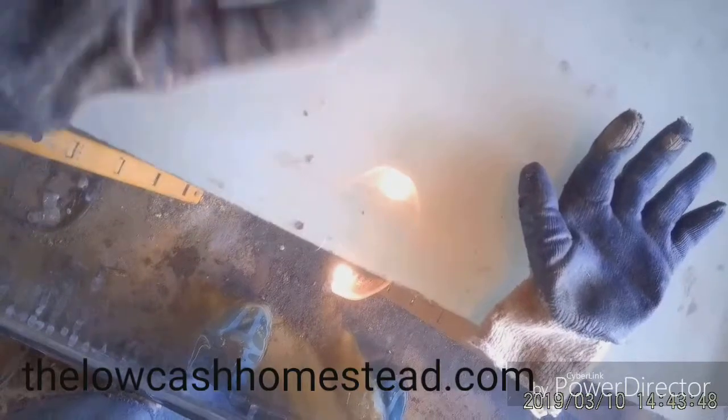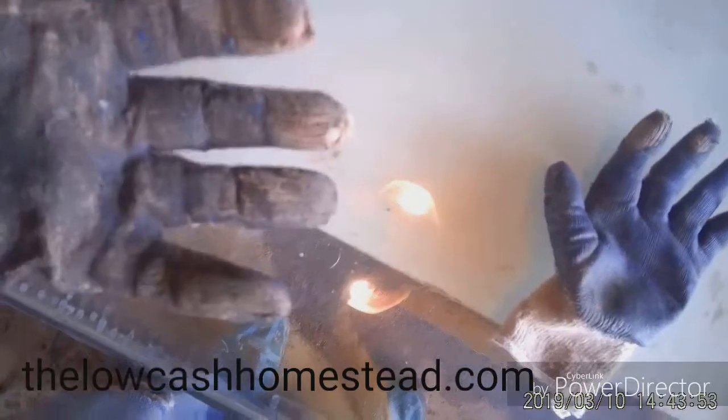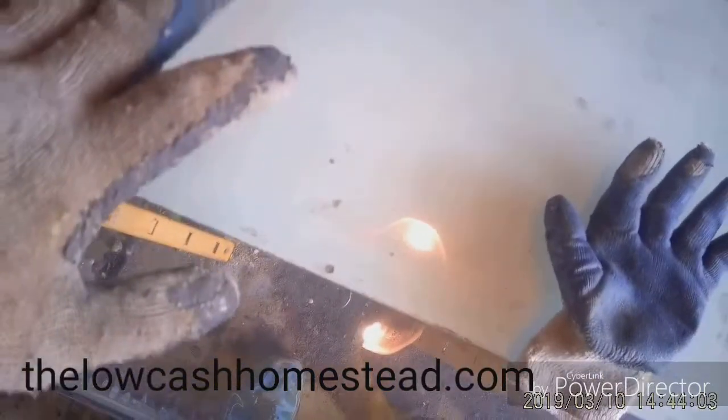The rubber coating is wearing off this pair, but I would use this one after I've applied the silicone so that if I get a smear on the glove it's not going to be a big deal. And if I get a smear on the glass it will be on the outside of the IGU where I can scrape it off.